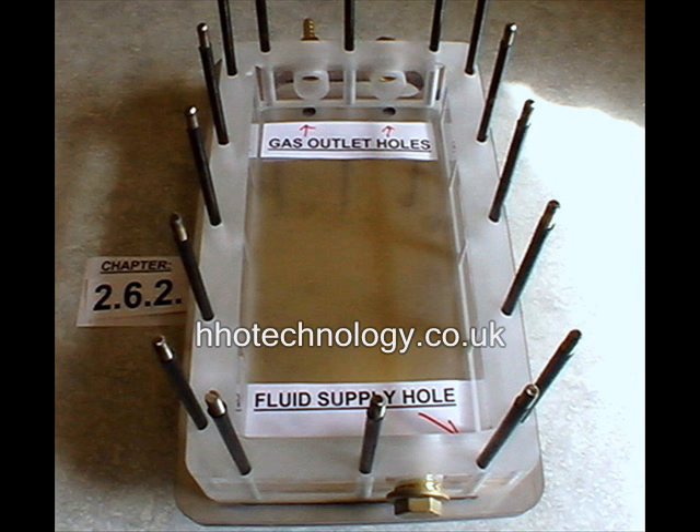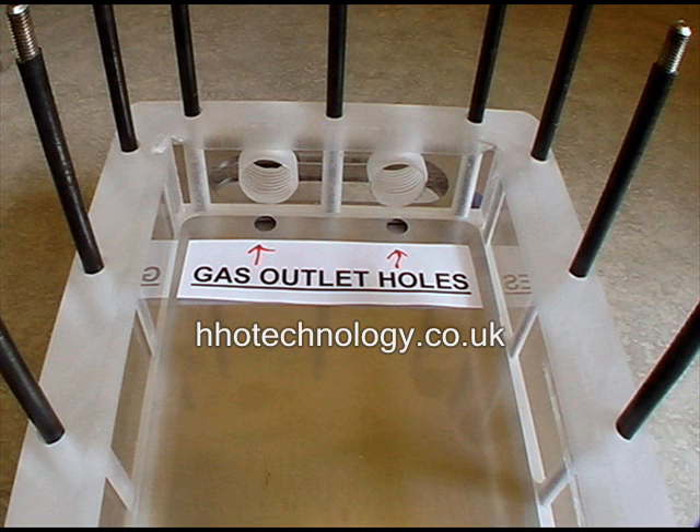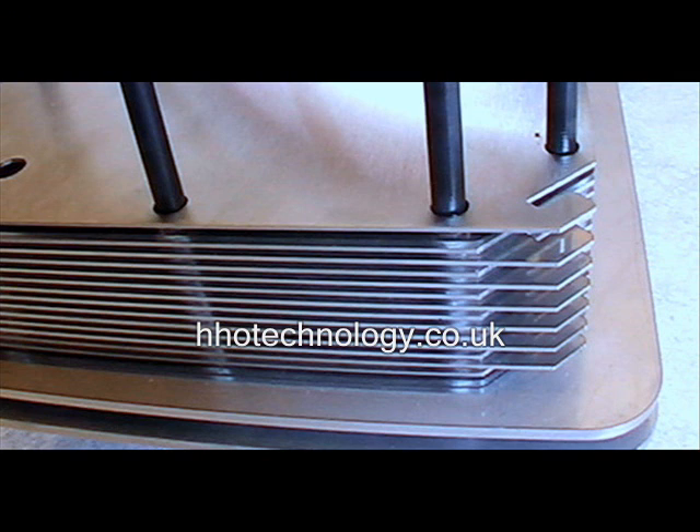Be sure to place the electrolysis plates with the fluid supply hole down and the two gas outlet holes up. Take care that the pins for the crimp connectors are always opposite the adjoining plates; otherwise there won't be enough space for them. Be sure to place the fluid reservoir with the two half-inch holes upwards. Be very careful not to perforate the heat shrink sleeve when stacking electrolysis plates, as this could short-circuit the threaded bar with an electrolysis plate and also short-circuit with the end plates.